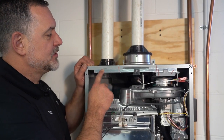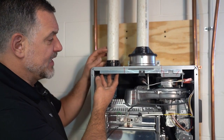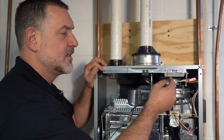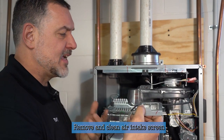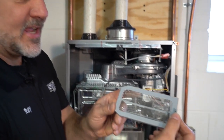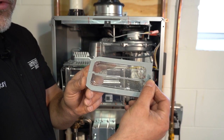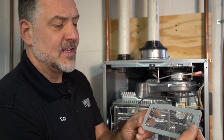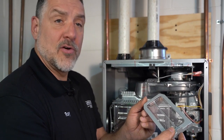This small shiny strip of metal here represents the air intake box. Air comes into the heater through here and then feeds the turbo. Before it does, you have a screen that you can just pull out — it'll show you if anything has gotten into your air intake. It's a good idea to clean this. You can see there's a little debris inside, so we'll just take a toothbrush and clean that out dry. Don't use anything wet, and it's important that you don't put the screen back in wet. It's stainless steel, but we don't want moisture in the air intake if possible.